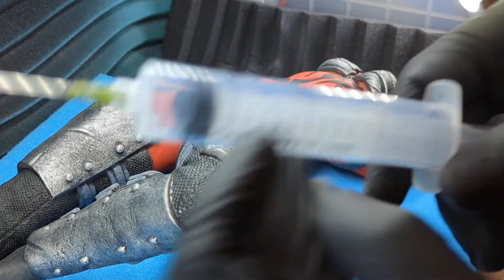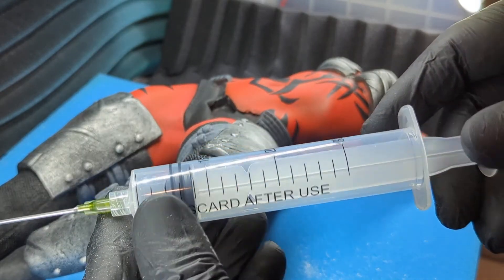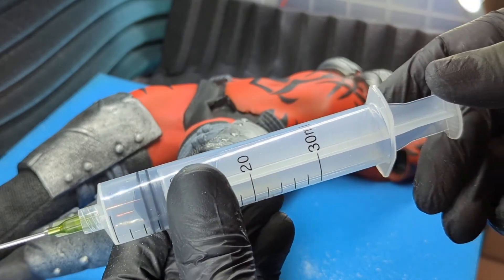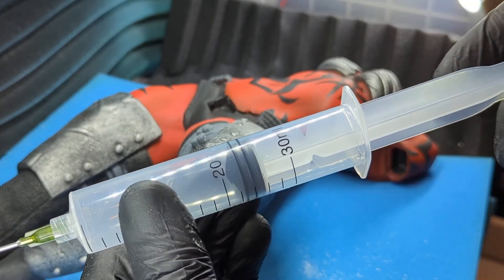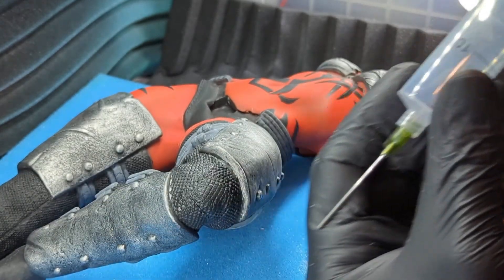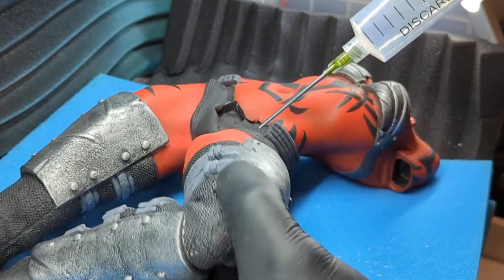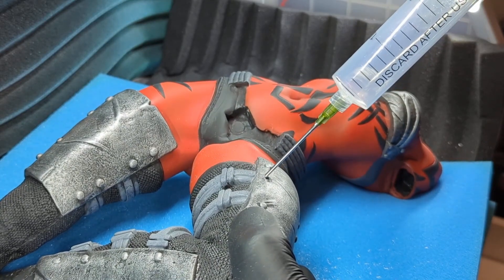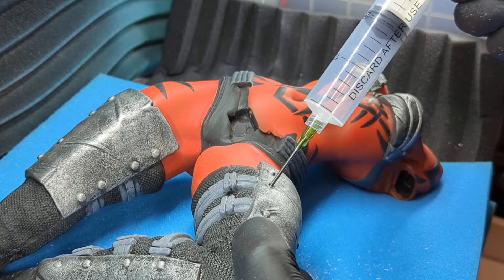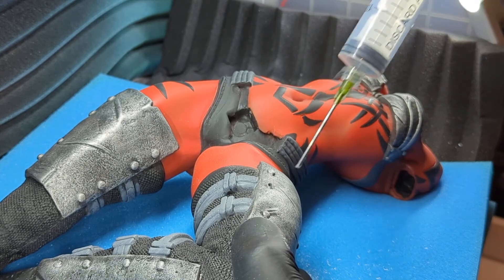This is basically a 30 milliliter syringe, and I'm using a blunt tip needle — I believe it's a 16 to maybe an 18 gauge needle tip. You want to make sure you have a large enough needle to where you're able to push resin through. Resin is a little bit on the thick side, so you definitely want something thick enough that it'll allow the liquid to flow through the needle tip. But at the same time, you want something small enough that you don't create a big hole when you drill into the part.